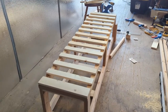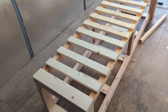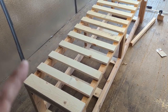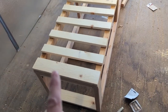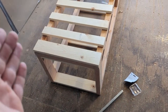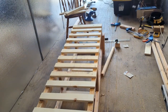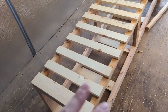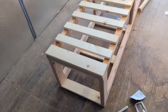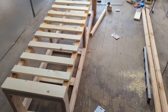Here's kind of what it's going to look like on the base piece — just the slats about every two-and-a-half inches so the slats can fit inside those. I'm going to use two screws to attach into each side, making sure they're even all the way down. I used three-and-a-half-inch pieces on both ends just to get over the two-by-four on that side and cover that side, giving it a nice flat surface. I want to test a couple first to make sure the gaps are okay so everything will slide and not bind up.